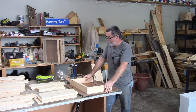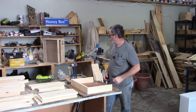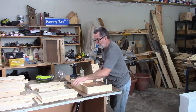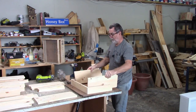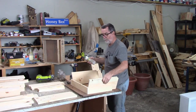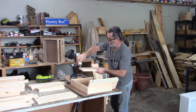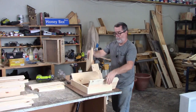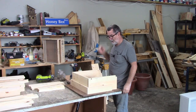Alright, today I'm going to try and get this thing assembled. I've made a little assembly jig or gluing platform — it doesn't keep the corners tight but it does hold everything in place while I'm gluing. I've got my main pieces laid out. The pieces with the little notch go on either side — I just kind of stand them at a bit of an angle to hold them for the moment. These are the sixteen and five-eighths. Then the eighteen and a quarter piece has to go across the back. Before I do that I'm going to put a little bit of glue on here and just stand that there at an angle. A little bit of glue, then stand that in there. This piece that's eighteen and a quarter will go in the back. Stand that up and it'll stay. This little jig doesn't hold it perfect, but that's fine.